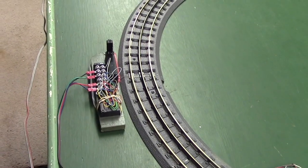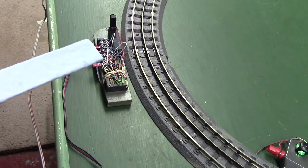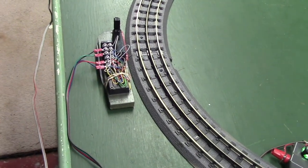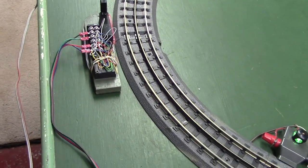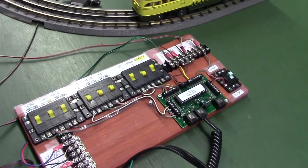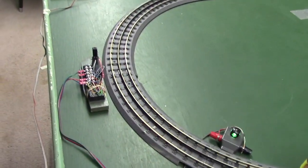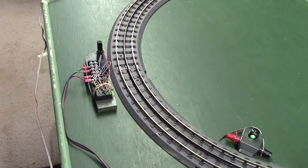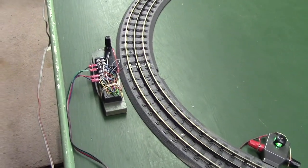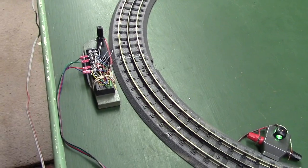That's the relay output. When a car goes in front of this thing and it changes to red, it grounds the green wire to the black wire, which essentially grounds the input on the controller and tells it the car is there. This could also be a reed switch or an electric eye, or any means of just connecting those 2 wires together, the same as the relay does.